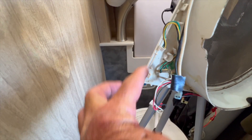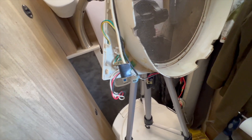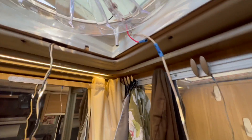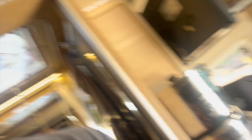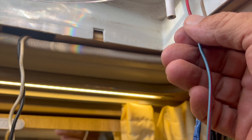The PCB board goes right here. I need to replace one wire up here with another crimp since I couldn't get it off the old board. I have a soldering iron, so I might as well solder the joint between the two wires instead of using a butt joint connector — I don't have one anyway. Soldered it up, heat shrink on it, good to go. No connector to loosen off.